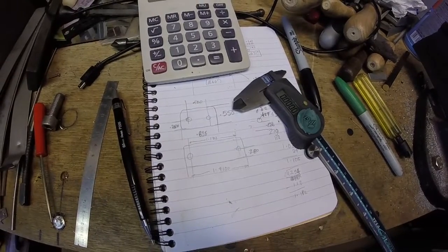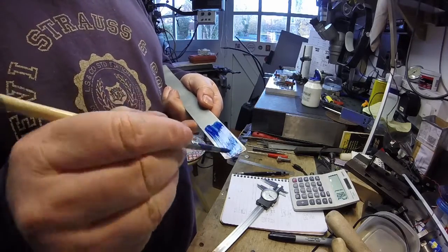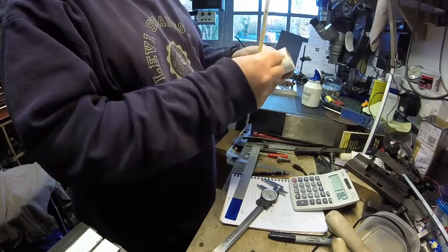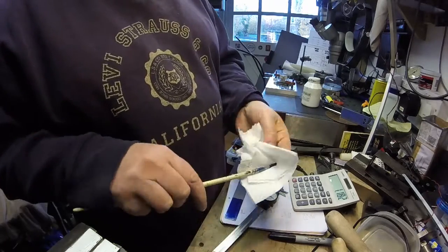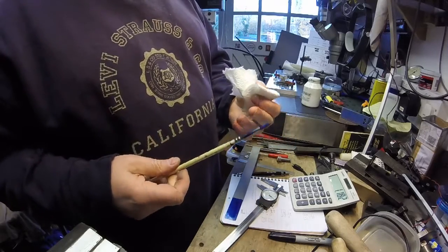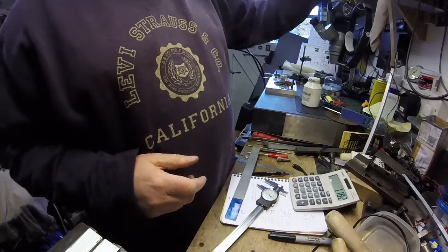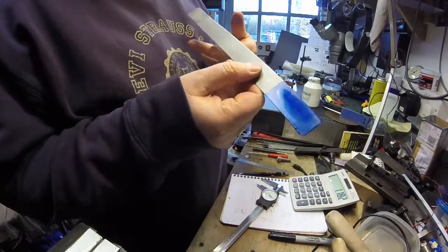I've got to make some holes in it as well — a couple of holes. I've got all the dimensions sorted out. Let's mark this up so that we can cut it out. Rather than putting the brush back into the pot of Layout Blue, what I tend to do is just get a paper towel and wipe off the excess, then let it dry within half an hour so it crisps up the brush again. Because if you keep it in the pot they all go horrible and seem to fall apart. This is just a hog hair artist brush but it actually does a really nice job. I think that's a fancy Windsor & Newton one but you can get away with the cheap one. So this is just curing.